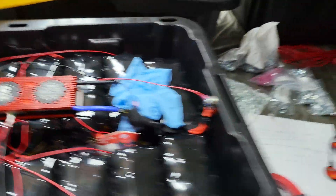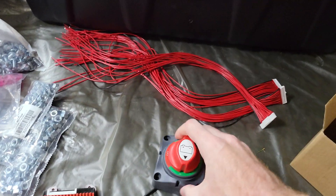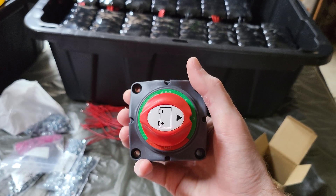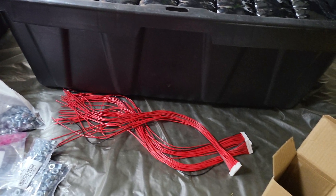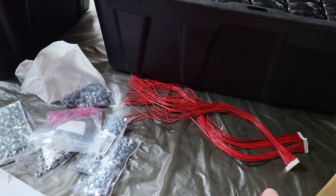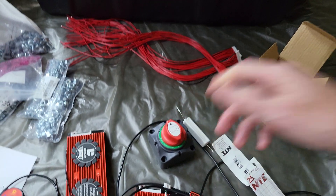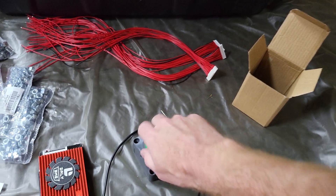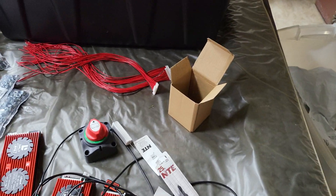I bought this switch — it's a two-way battery switch, or three-way depending on how you look at it. You can set the battery to off, one, two, or one-plus-two. What I'm going to do is take this 25-watt 30-ohm resistor and gang the one and two terminals using it, then put the battery on either one or two so I can flip the switch to prime it first — avoiding that arc flash — and then go to two with a direct connection that bypasses the fuse. So I just go one, two, three: up to one-plus-two, then straight to two, and it should be fully charged and ready without any arc.